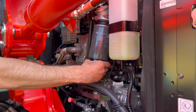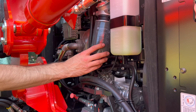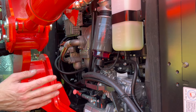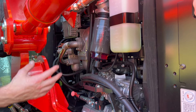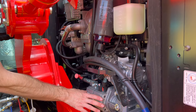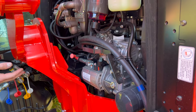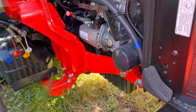The fuel filter has a fuel heater in it, which helps to not allow the tractor to gel up in cold weather. It also has a sight glass, a water separator drain plug at the bottom, and a primer. So this is a top-of-the-line fuel filter — one of the more expensive on the market, but they last longer. Any person that's ever run diesel in New England or cold climates will tell you how much of a pain gelling up is, so this is going to prevent that immensely. Dipstick back here, your main hydraulic pump — that's pretty much the normal stuff you'll be touching.